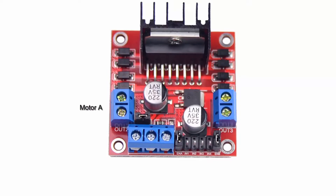This is motor A connector, and this is motor B connector. To control two DC motors, you connect one motor to the motor A connector, and the other motor to motor B connector. The polarity is not necessarily important. To control a stepper motor, you need to connect one phase to motor A and another phase to motor B connector. You can use a unipolar or bipolar stepper motor.